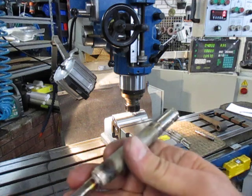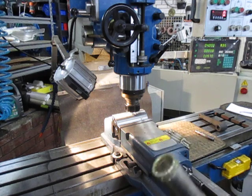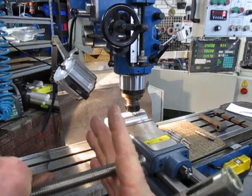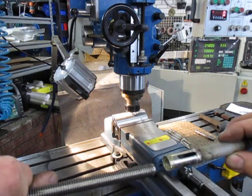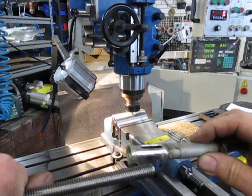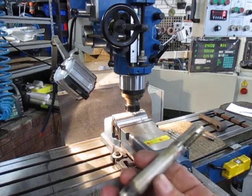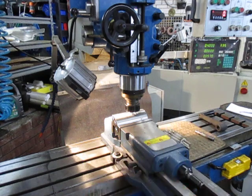This one still has to be finished. The idea I came up with is to be able to drill the gypsum or hypersaline salt that's built up around these bolts. These bolts are studs and they hold a housing — there's a second housing on top of them and they can't remove these because the gypsum builds up and locks them. So this drill drills down and drills out a cavity using the diamond drill, so then the two sections — the oil housing and the cap — can be parted. I've made up four of those as per request, and this is a new model with a drill end rather than a socket so that they don't destroy them as quickly.